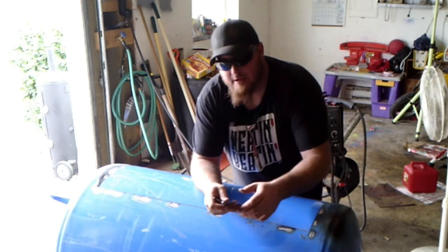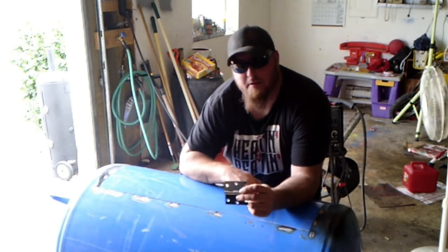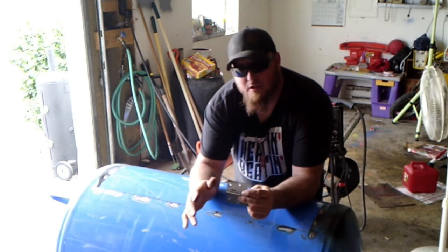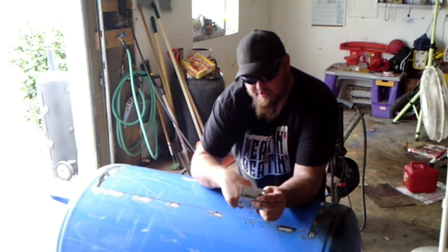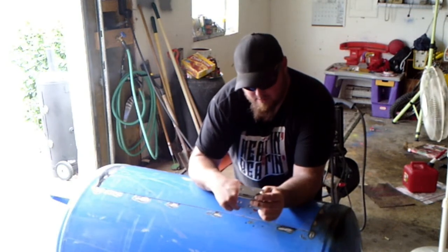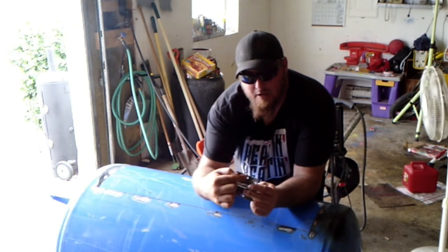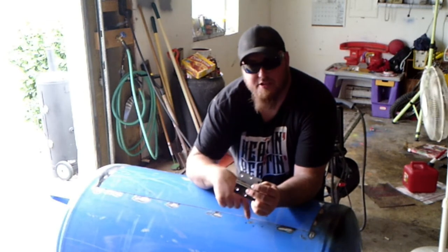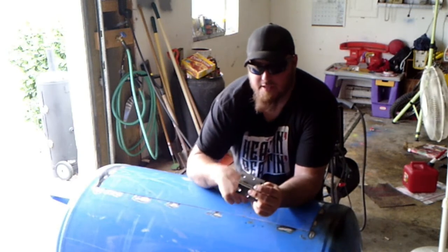because when you're welding a hinge in, just taking the metal off and welding the middle of the hinge on works okay, but if you want a good penetrated weld, you actually drill all the way through the piece that you're attaching the hinge to as well to get that good penetration. And I think what we're going to do is just drop a quarter inch bolt in the middle holes to suck them in and hold them there and make sure everything's lined up for when we go ahead and weld these. We're going to go ahead and drill these out right now.